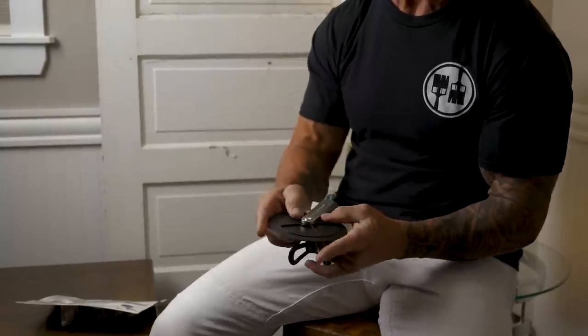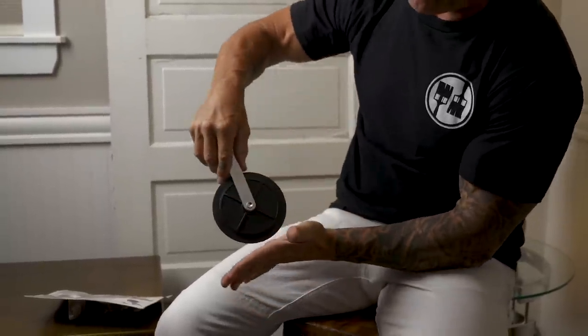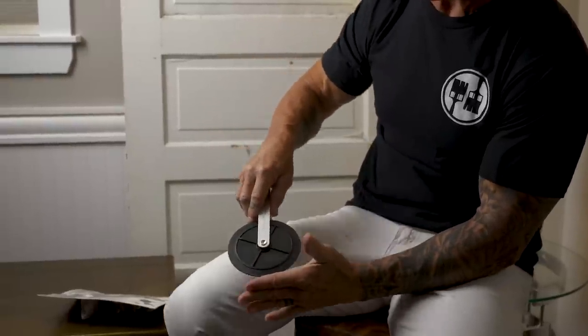We're going to show you some basic scenarios that you're going to run into. What we see here a lot is orange peel texture, knockdown texture, your ceiling, you're seeing textured walls going into a textured ceiling. It's very rare that we ever see smooth walls, but even with smooth walls, do you have a perfect 90 degree corner where you don't have any peaks or valleys? Because as this thing rides up onto peaks and valleys, you're going to have paint bleed underneath this spray device. And also this spray device has a very, very narrow contact path in overspray.